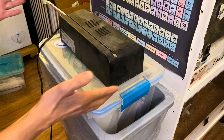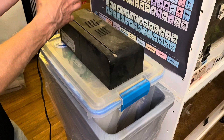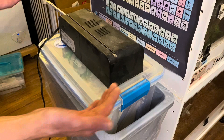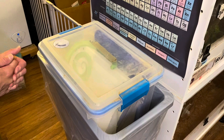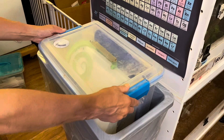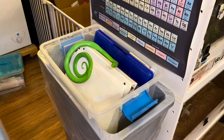Let's say you have a tub set up with a screen installed on the top and a light on top. In order to get into the tub you'll have to take that light off — whether it's a single dome fixture, a double dome fixture, or something similar. The best approach: come from the side, slide that light back, and lift it off the enclosure. Then to open the lid, slide your hands to the side, unclip it, and lift the lid off towards you and down.